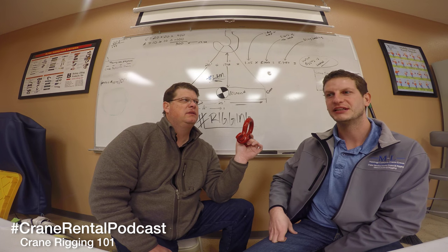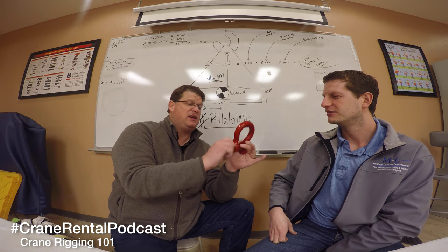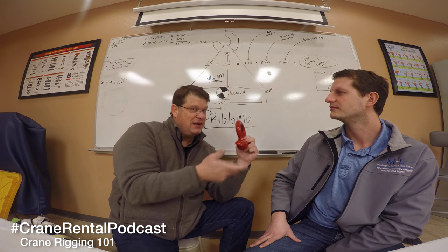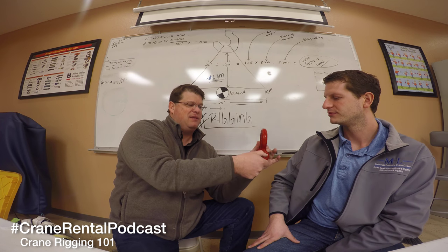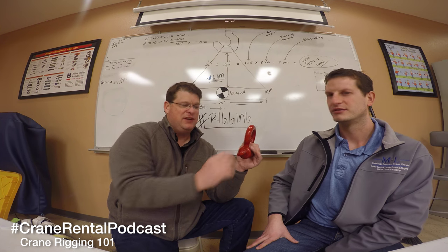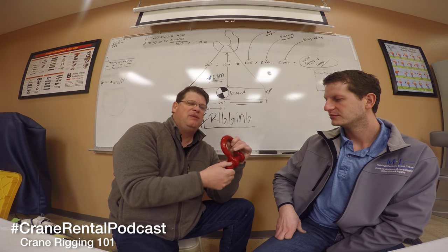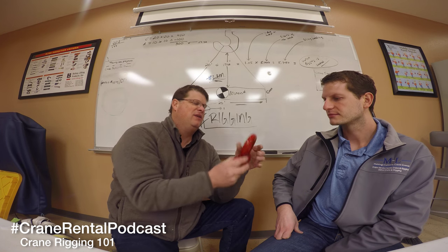The reason people do this is so they don't need a breaker bar to break it off later. What happens is if I just seat the shoulder and do a net capacity pick, this will tend to be really tight when I want to take it off. So people back it off to mitigate that. But what you've done is incorrect - the manufacturers all say to firmly seat the shoulders. That's why they're flat and have a hole for a spud wrench or breaker bar, so they can be removed.